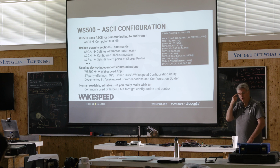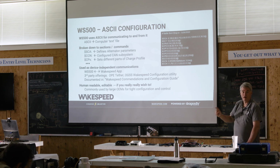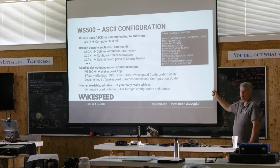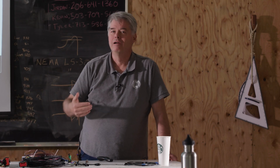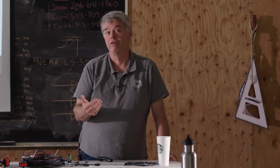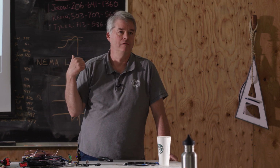But you have to know, whenever you're working at the expert level, either doing it the hard way by editing these or in the app with expert toggle on, all of these numbers are defined as a 12-volt, 500 amp hour battery. So for example, this number right here, 250, that is defined as max battery current. 250 is half of 500, 0.5. That's how you make a 0.5 C rate. That's how you define it in here.